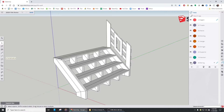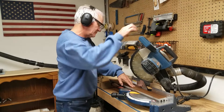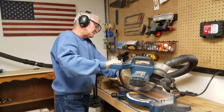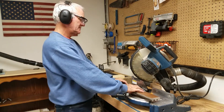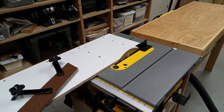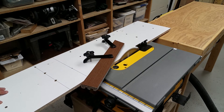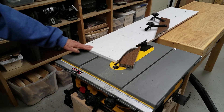All we really need to do is add a railing and then at the end we'll add a handrail. To look at the railing, we'll spin around to the back so we can see the pieces that make up the railing. We're slitting some of that tread material in half so we have half-width material. I'll be using two power tools to cut the railing pieces. For pieces at about a 45 degree angle I can use a standard miter saw. However, there are some shallower angles I need to make for that decorative O-looking piece in the center of the railing, and for that I have to pull out the sled and use a table saw. I'll clamp the piece of tread material down to the sled and then run it through to get an accurate shallow angle on those particular pieces.